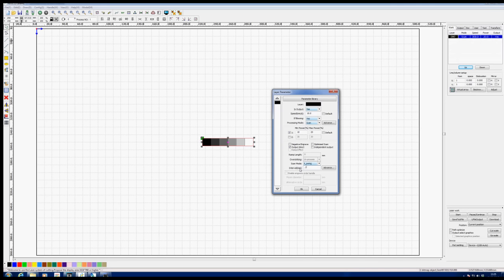Now, when we talked about real engraving, we were talking about a tool which was triangular in nature, so that as you increase the depth of cut, you also increase the width of the cut as well. This point one that's shown in here is the spacing between our parallel lines. But of course, we don't have the opportunity with a light beam to change its width. It's going through a lens, and it will remain exactly the same width. The only thing that we can do is change its depth. And unlike normal engraving, changing its depth will not change its width.